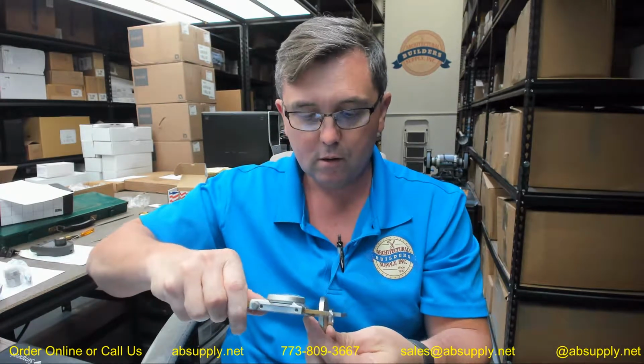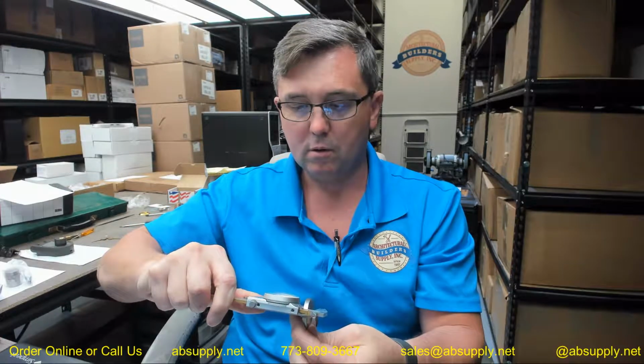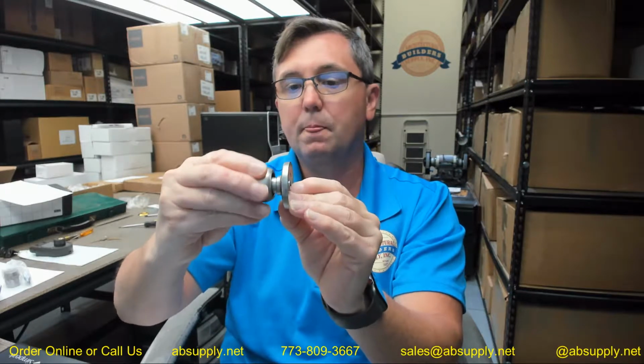I'm going to tell you what that dimension is, because the bolt has to pass through the back side of the back plate altogether. I'd add every bit of a 1/4 inch. Just the door thickness plus a 1/4 inch, plus a 1/4 inch to go inside of here. Okay? 1/4 inch to get through that plate is what I'm saying. Maybe almost 5/16. Okay? That 1 7/8 screw will probably work on, will certainly work on a 1 3/8 door.